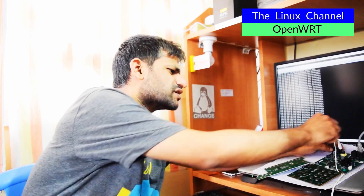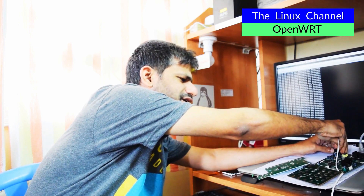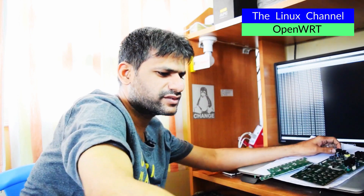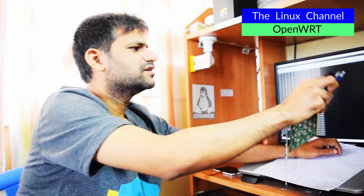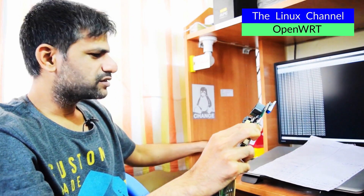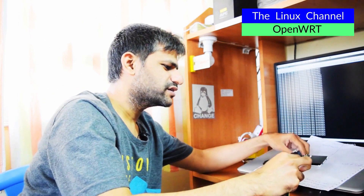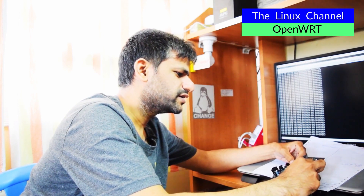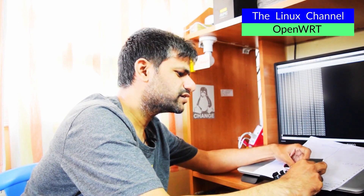It is not coming up. Maybe it is expecting this LCD or something. What I can do is disconnect this and connect the LCD. Like I said, this is a very old workflow. I have no idea what its initialization and specific guidelines are. I'll hook this LCD display — it has this backlit but I'm not connecting that. I can just hook through this flat flex cable and then check once again.